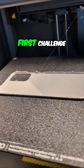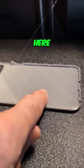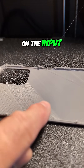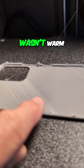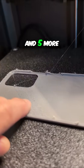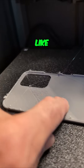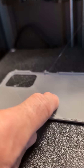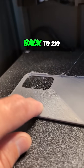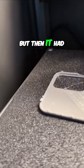This is the first real challenge I've had with this printer. You can see it was going great, and then since it got clogged on the input side, I wondered if it wasn't warm enough, so I bumped the temperature up five degrees and it got a little stringy. Five more degrees and it got super stringy. So I set it back — I went from 210 to 215 to 220 and back to 210 — and it finished out, but then it had a problem again.